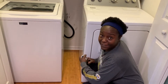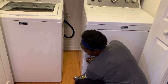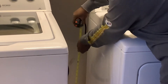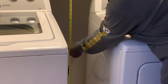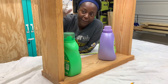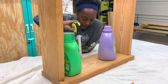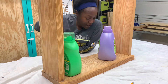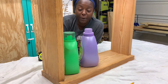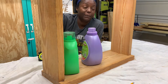We're going to make a simple but heavy-duty laundry cart to go in between the washer and dryer. I have some three-inch wheels that the cart will sit on, so I need to subtract that from my cuts on the wood. I want the cart to be at least 38 inches high. This is a preview of what the cart is going to look like — I want a wider base than the sides. This is regular pine, one and a half inches thick, nine inches across, and seven inches on the sides. The main purpose is to hold heavy-duty laundry supplies, and we're going to start out basically with a box.